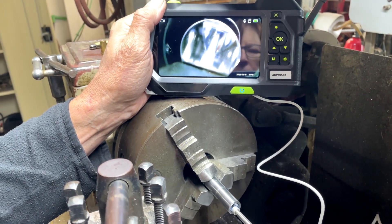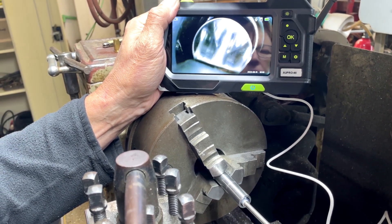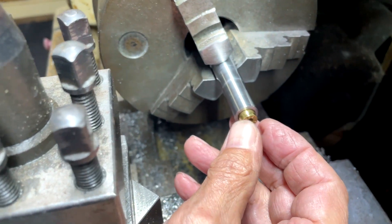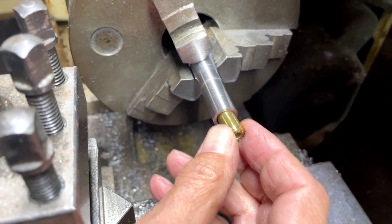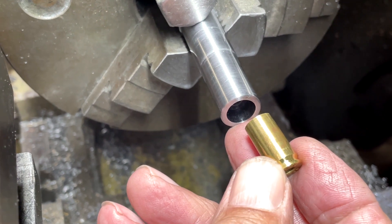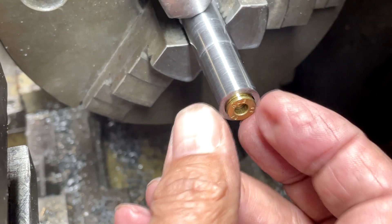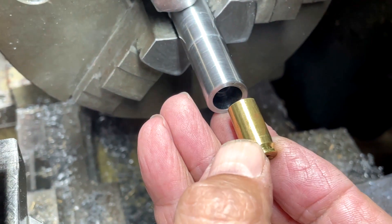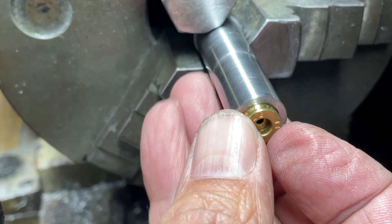This makes your chamber perfect and slippery to eject the cartridge easily. Our 9mm case will slide into the chamber perfectly. The burnishing rollers are set at an angle that matches the contours of the case, and it gives you that perfect shape for the chamber. So you end up with a chamber that's nice and smooth, as good as you can get it.